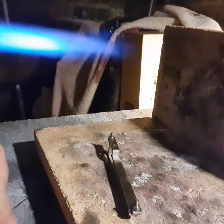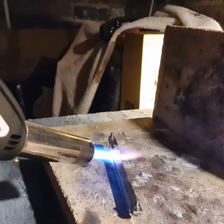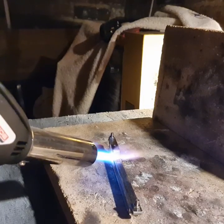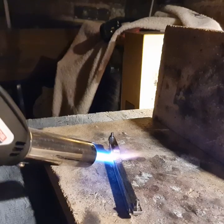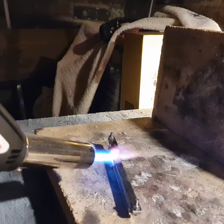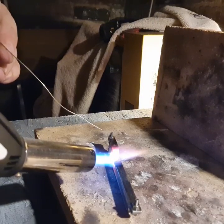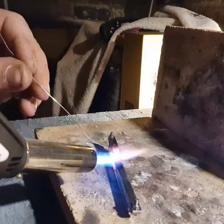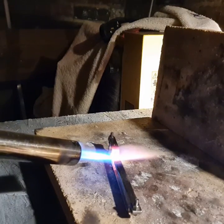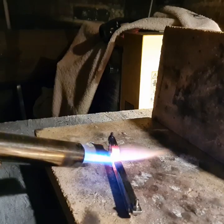We're back in the zone again with the gas, so we're heating up that joint until we get it glowing. You can see the flux burning off — the water in the flux burning off. I'm going to watch the metal, not the flux. You can see that top piece has started to glow already — it's this bottom one I want to go with it, and the flux has now gone to like a water consistency. Touch it — job done. Yes, I've got a little bit excessive with the silver solder there, but I don't care.